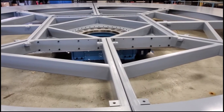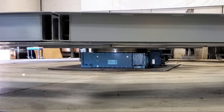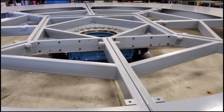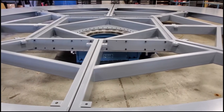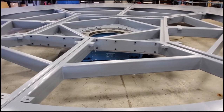It has fixed 40 stations, so there's no programming, utilizing only a simple AC motor, one and a half horsepower. This Index Drive features 20 cam followers that are internal to the indexer, lacking mechanical dwell. It only stops based off a simple proximity switch, and this Index Drive rotates this load in about 4 seconds for each index.